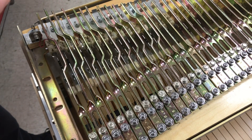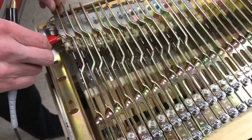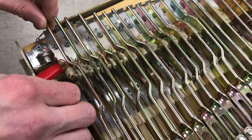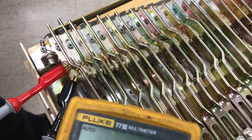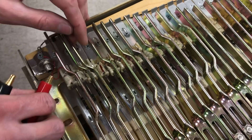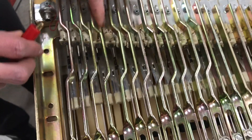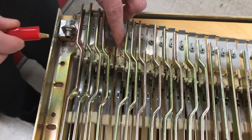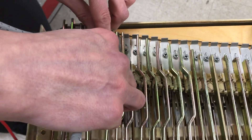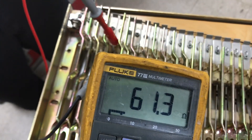Here we have a working 73-note piano, and we're going to show how you can check the whole piano to see if the pickups are working. As noted from our chart, the first grouping is a group of four — it reads 45 ohms. Moving up past that grouping to the split point where there's a gap in the wiring, we put our meter across there for a group of three and get 60 ohms.